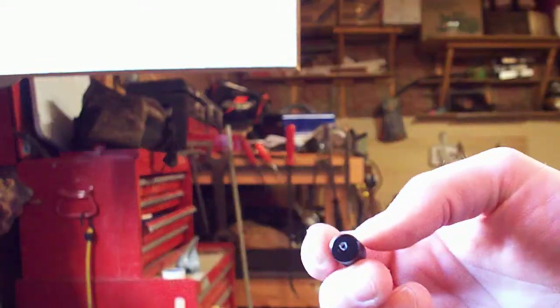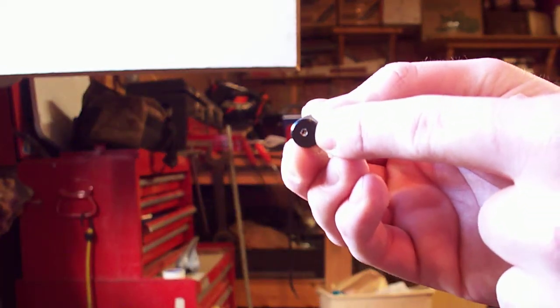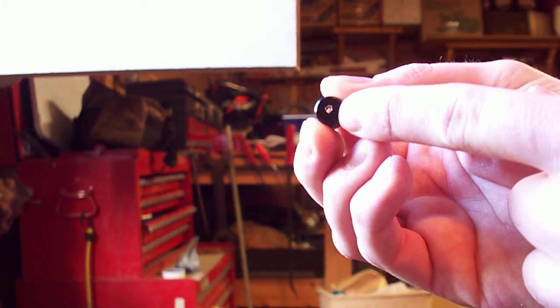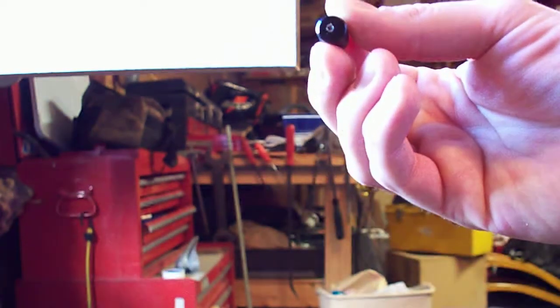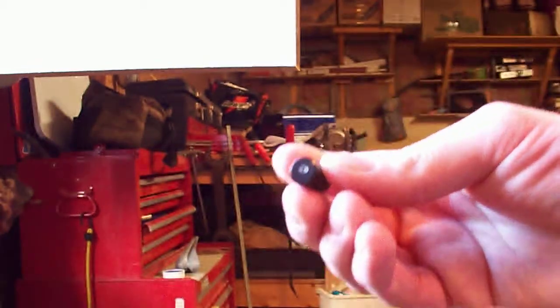After you drill your starter hole with the 1/16 inch bit, you can recenter the hole with the 5/64 bit. Generally you want to get this as close to centered as you can on the first drill, because there's not a whole lot of adjustment you can make with the 5/64 bit. Once you've drilled that hole, take your inflator needle and stick it through the back side of the cap all the way to the front.